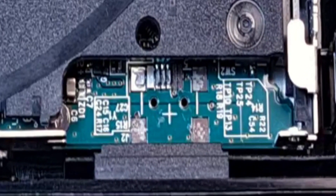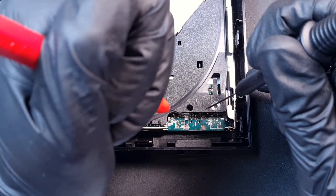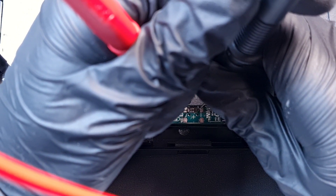And here is the pin-out. As you can see, there are missing pads for the ID line and ground. I will try to recover the ID pad from vias below where the pad should be, and scrape the protective film at the left of the ground pin so the circuit will be exposed.